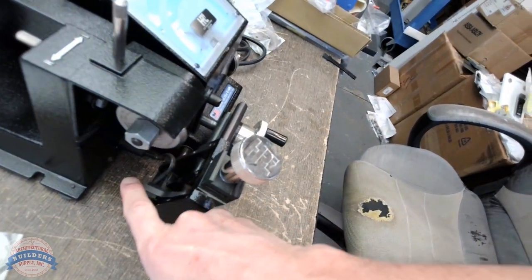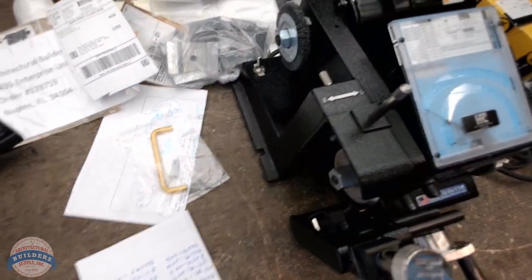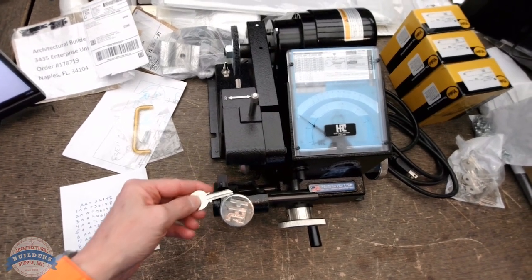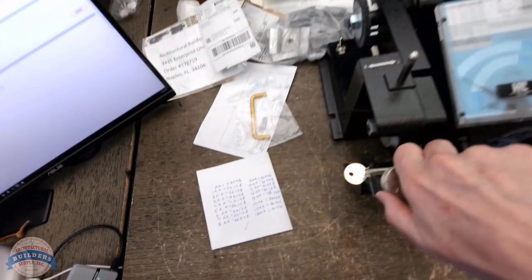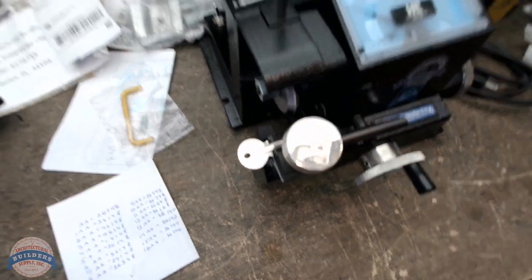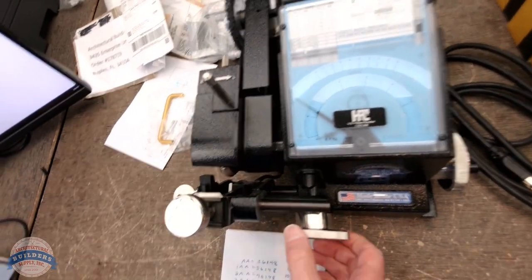Okay. There's a micro switch down here. The machine will not start unless you reset your key gauge. Okay. My blank is going to go in. I've got my key blank in there. Everything looks fine and dandy with that. And we're going to cut 36148. So the first thing that we're going to need to do is move our x-axis to the first position. Okay, and that's this wheel over here.